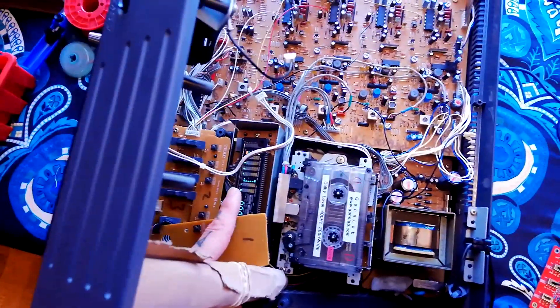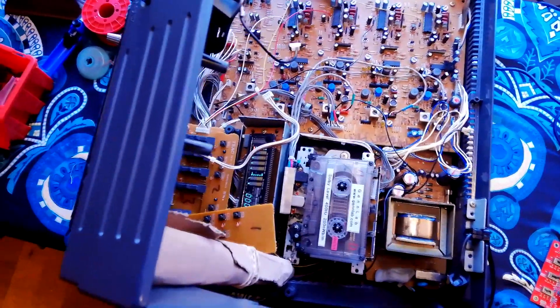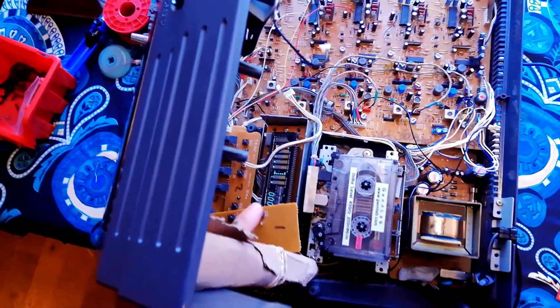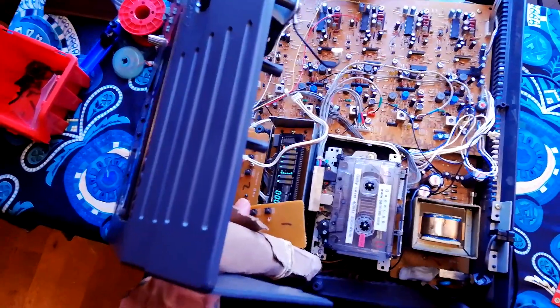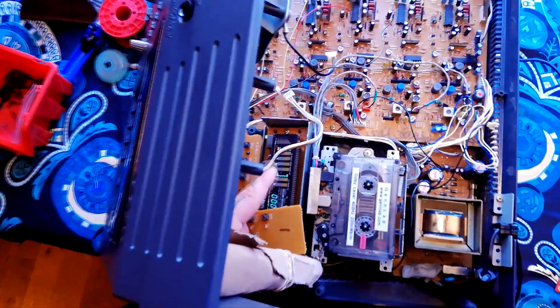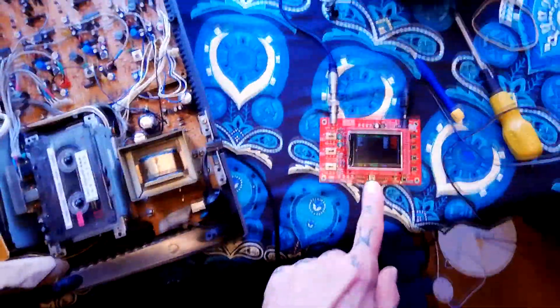Although I've gone into quite a lot of detail about how to calibrate the meters on the 244 — because they're analog and that is an important first step — I haven't found any problems with the digital meters built into the 464, 424 Mk2, and 424 Mk3. They can be depended on, so in a lot of ways you can actually just use them to measure playback and recording signals directly without using an oscilloscope.